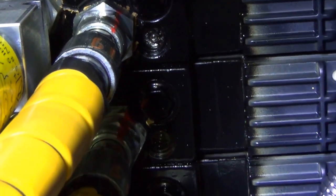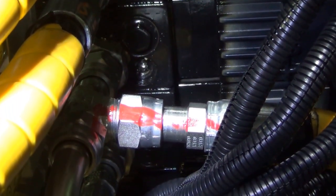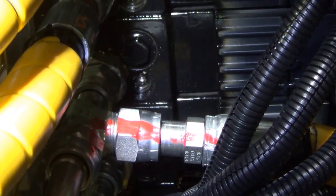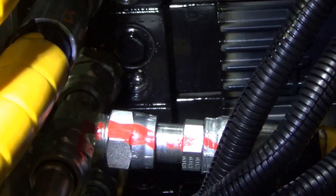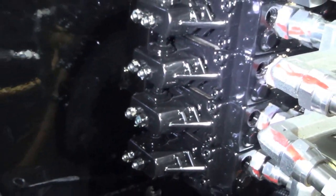Our pressures out for our wings we want at 750. There's actually the port for the left wing going out. That's our scraper — scraper down on this side here. This can change with your valve if it's hosed up a little bit differently, but you're still able to adjust each section and each function going the separate ways, up and down, in and out. There are the pressure ports on that side, and we have them again on this side — you can see them on the top of each valve section there. And that's how you adjust your pressures.